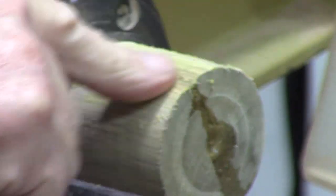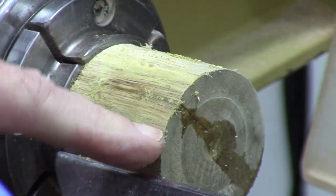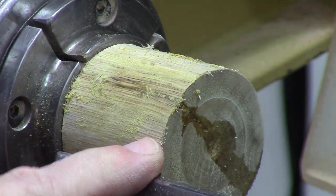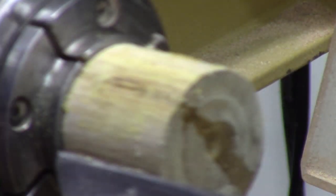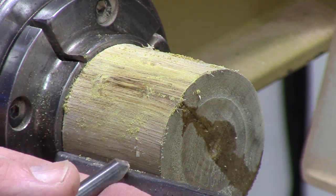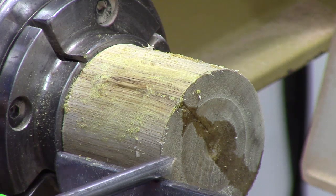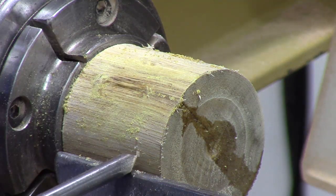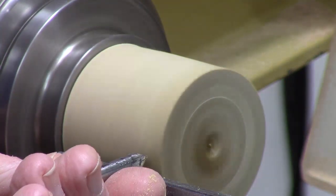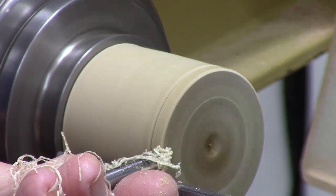The dust I put in here looks like Osage orange and won't match too well, but that's okay. I just want a nice smooth surface to grab hold of. Next thing I'm going to do while that's drying is put a tiny little groove here — that's what the chuck's going to hold on to when we finish off the bottom — and we'll add that with a point tool. On the Teknatool jaws, because they're not a true dovetail, you make a parallel tenon but it will grab very well, and it makes a design feature.